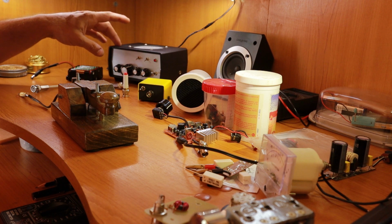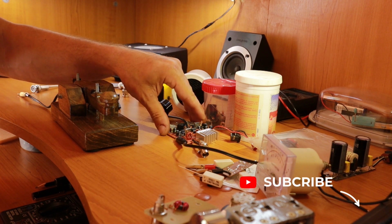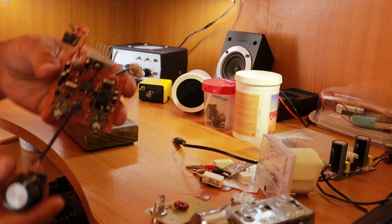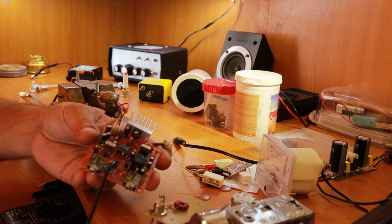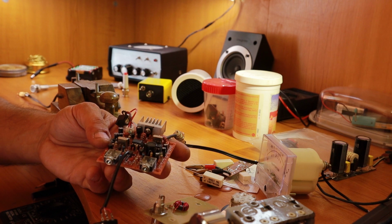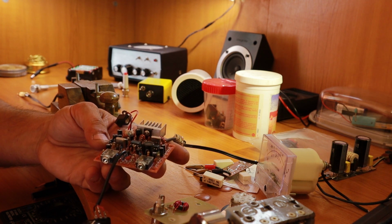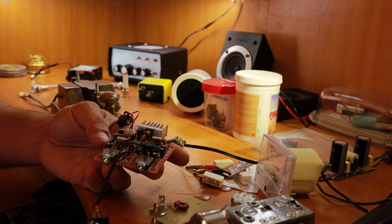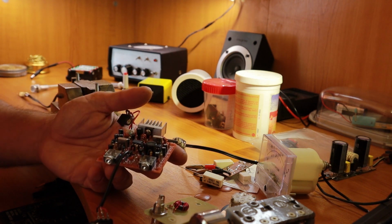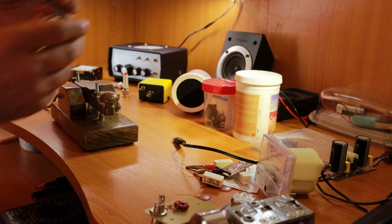After that, somewhere between the older versions of the Sputnik and the new one, I received a present from my sister for my birthday while I was in Italy, once I came back from the sailboat: the 49er QRP kit. This was supposed to be a 3 watt, 40 meter band CW transceiver, fixed frequency, crystal controlled, but I never got that power out of it, actually less than half of that. So I ended up changing the final transistor with a BD139, and now the output is somewhere over 1 watt.